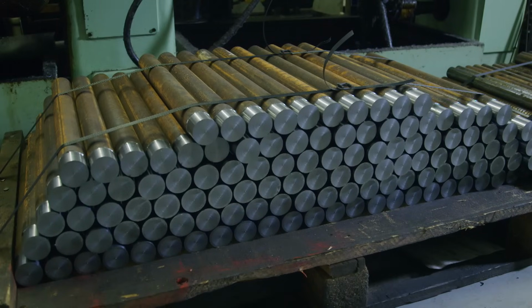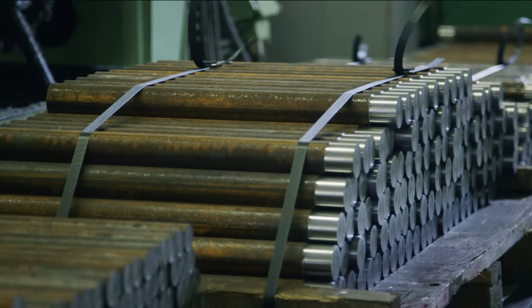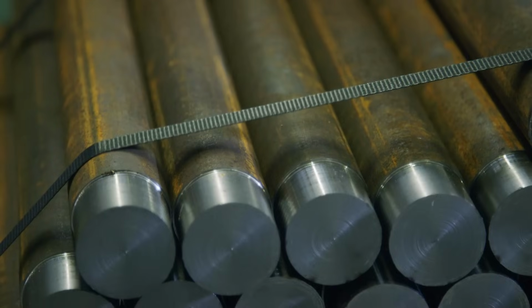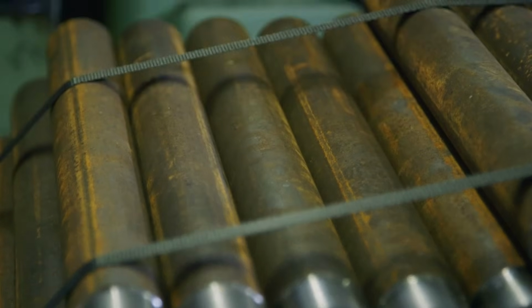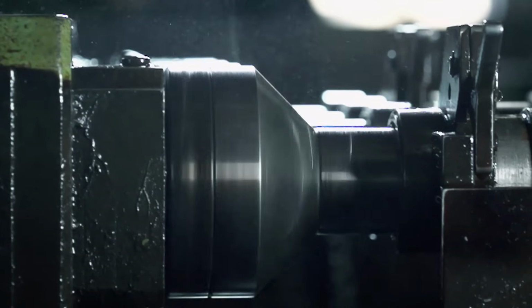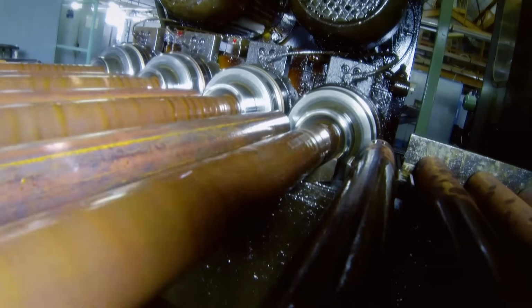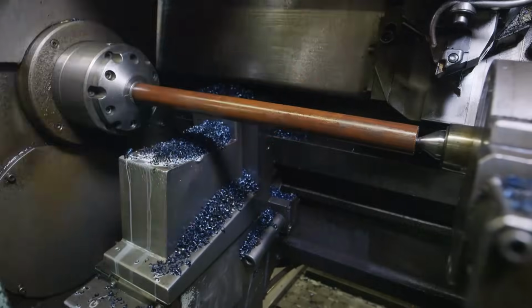The barrels of the CZ75 arrive coated in rust. They're actually left outside during the changing seasons to be weather cured, which toughens the metal, a CZ family recipe. The barrel is made from a special alloyed steel, heat treated for hardness. Holes are bored through the center, 4 barrels at a time. Then the rusty outer bark is scraped off.